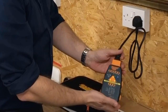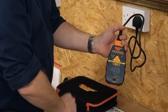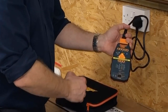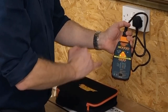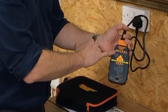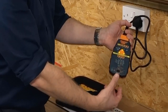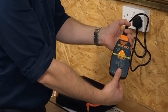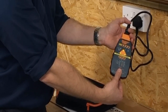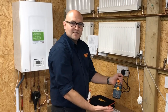For this demonstration I'm just going to plug straight into the 13-amp socket. As soon as we power the unit on it does our socket test and tells us what voltage we have present at the socket. Then simply press the loop test — it will perform a no-trip low-current test and give us a go/no-go indication. In this case we get less than 1 ohm earth loop impedance, which is a good result. It also has a polarity test pad — simply hold your thumb over it and if everything's okay we'll get three greens indicated.